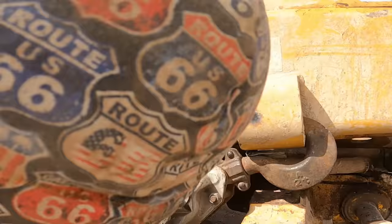It seemed like as I was bridging the gap, it was too thin. I wasn't able to penetrate the parent metal as good as I thought. So, little plate won't hurt. And, you know, again, it's just a tensile pull. So let me grind that up, cut some plates, and get done with this baby.